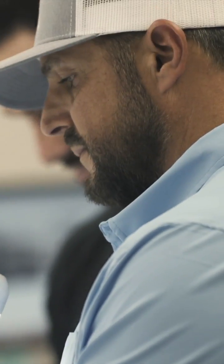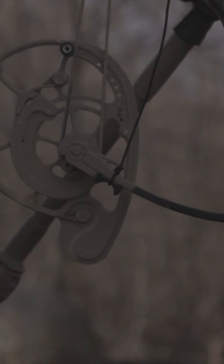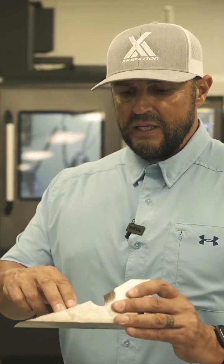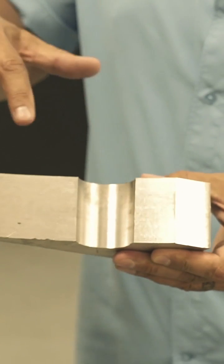Part of this material too — the process that makes it — the extrusion process is under constant pressure, along with the type of materials used and how they cool it, and then it makes a solid billet. As you see, this has been cut. You don't see any pores in this. This is just a solid chunk.